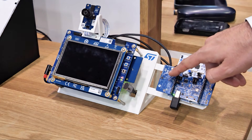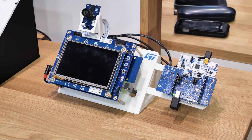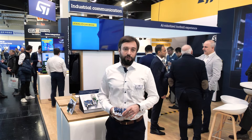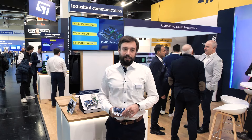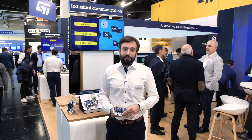One of the variants, ST60A3, supports modes that can bridge standard wired protocols such as high-speed EUSB2, UART or I2C tunneling. Additionally, it allows wireless control or state reading of GPIO pins. The ST60A3 even integrates an antenna, which saves more PCB space and eliminates RF design complexities.